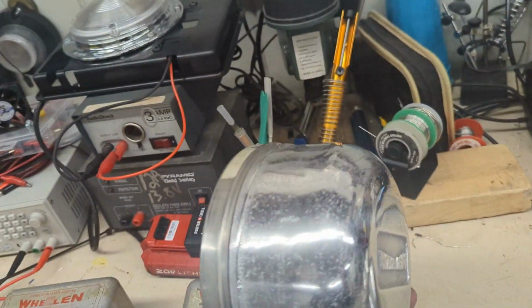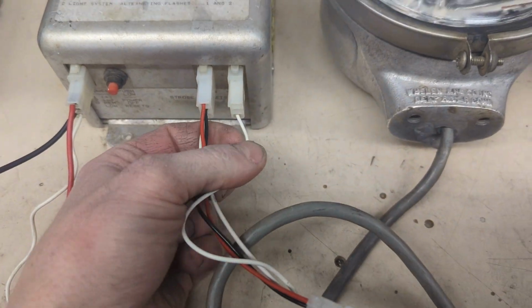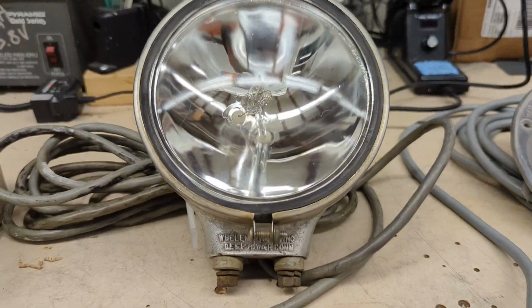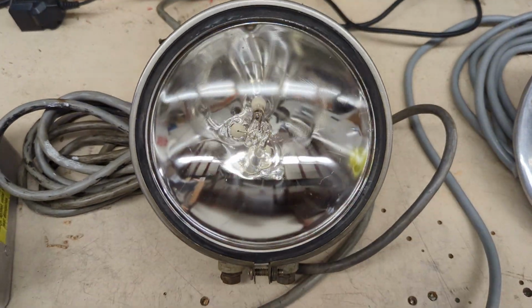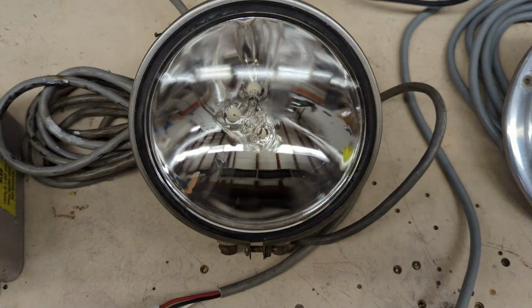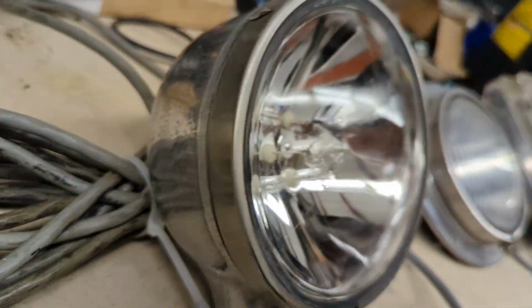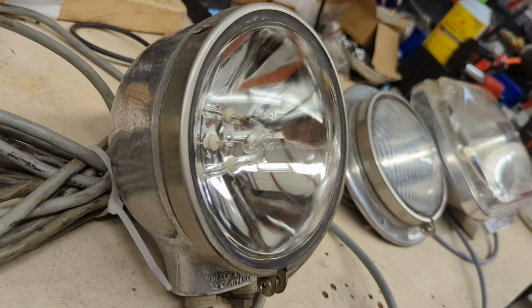Here we see what I commonly think of as an example, and it's powered by using the trigger of two strobe heads to power the single one. They were very specific about the 120 double flashes per minute, and the only way to achieve that with the power supplies of that era was to modify them internally or externally by combining two heads into one.